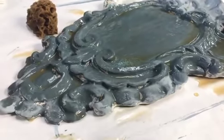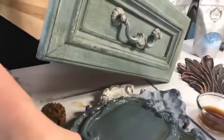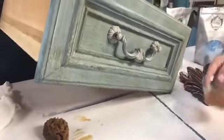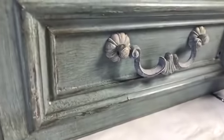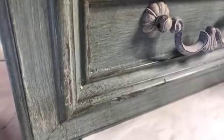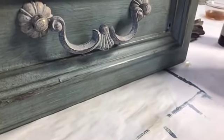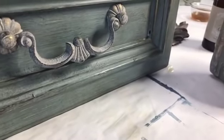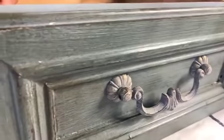As the antiquing glaze dries, it literally pulls the paint away and allows me to get the worn look. Look at the depth on this piece — I painted it first in One Step, then put on Cracked Gesso where you can see the cracking and popping details, then one coat of milk paint — Amalfi Coast mixed with black — then came back and waxed it.